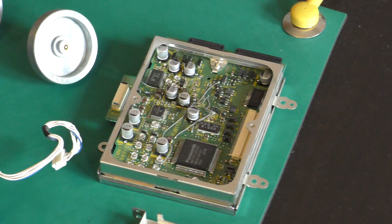In many of our previous videos we have shown you that all SMD capacitors on the read-write board need replacing. You will need to replace all 10 with the same size SMD version since regular through-hole capacitors will not fit.